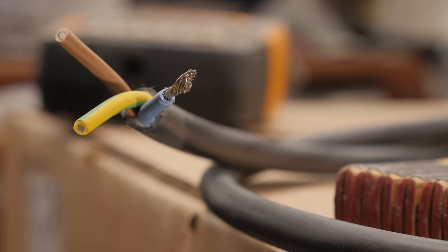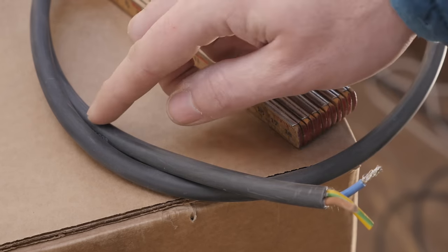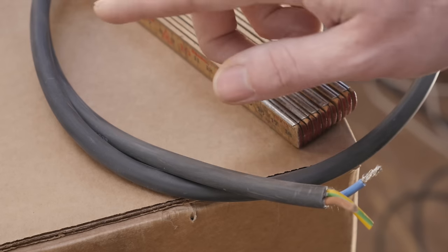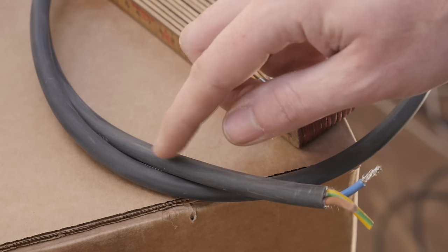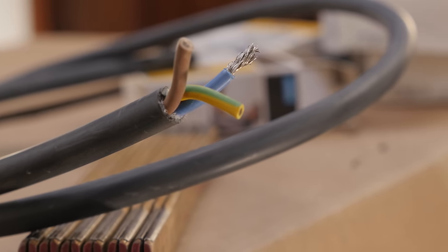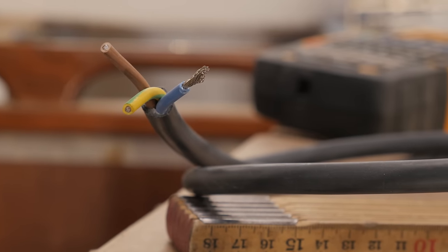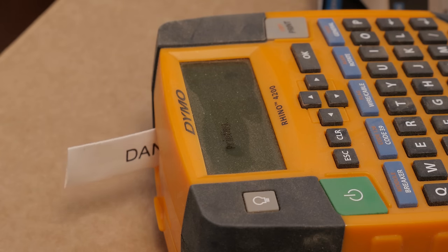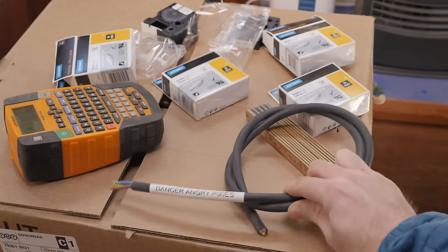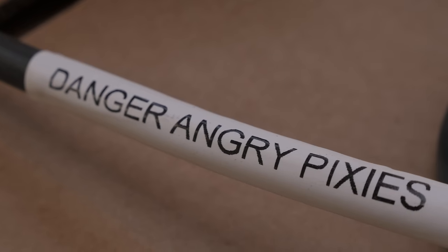It's perfect except for two things. The first is the color of the cable — the outer insulation is black. I don't believe I'm not allowed to use black, but it would be kind of nice to have a different color than red, black, and green and yellow, because those colors are going to get used for other stuff aboard the boat. Before you comment, if you're located in the US, please bear in mind that we've got a different color coding over here. The second thing is that I can only find somewhere I can purchase the 2.5 square millimeter version of this cable. That's somewhere between a 12 and a 14 gauge wire, and this is for AC, so that would be overkill. 1.5 square millimeters would be perfectly fine to use.